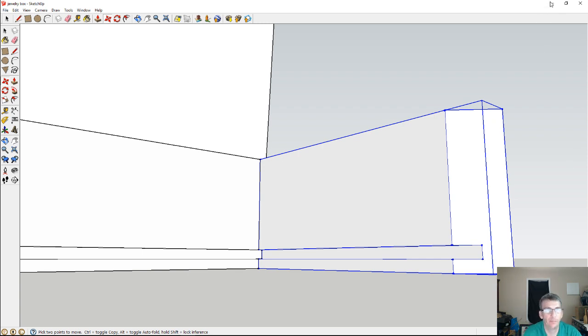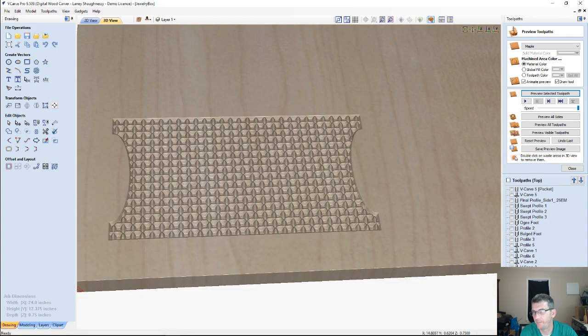Yeah, we're not doing a butt joint. If we were doing a butt joint, it would be completely different, Chuck. We were not doing a butt joint. So with the miter, with a butt joint, we would do completely different. We wouldn't extend those parts all the way to the end. We would extend them 3/8 inch in from the end on both sides.